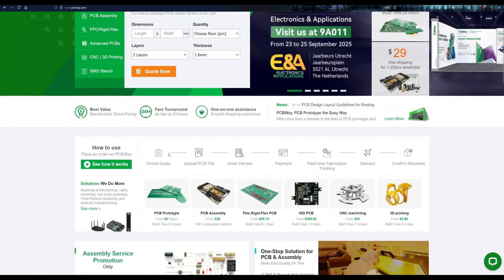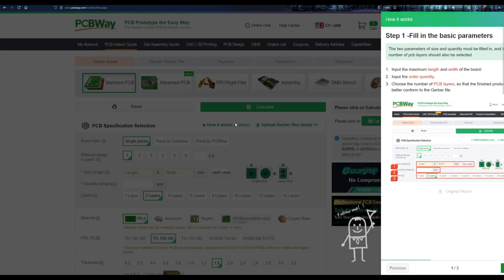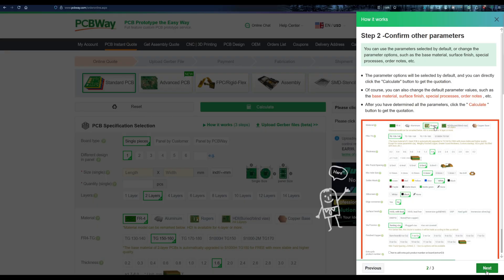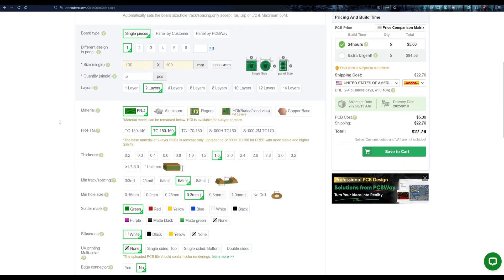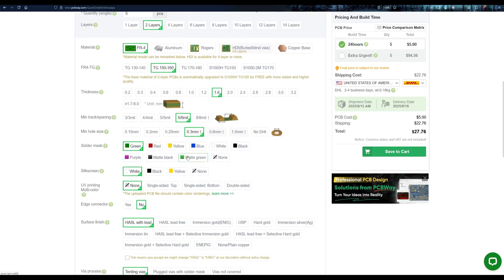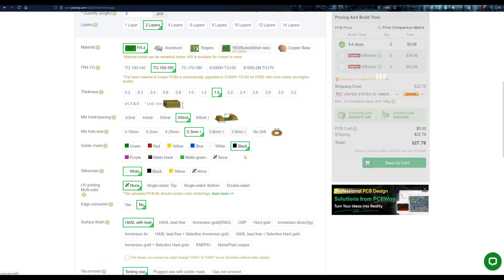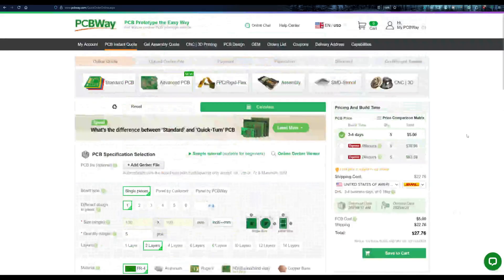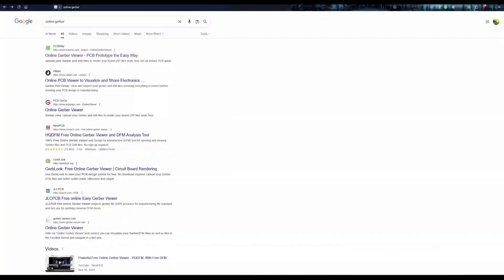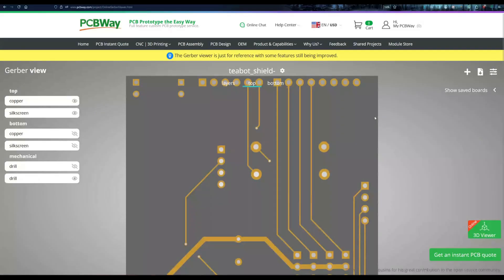Once you finish your PCB design, you generate a Gerber file, then we're going to use PCBWay since they are technically the sponsor of this project — thank you PCBWay. Upload the Gerber file; it's pretty straightforward. Most options you don't have to change. We're using two layers since four layers significantly increases the price. The color doesn't change the cost, so save to cart. An engineer will review your PCB design — since it was my first time there were some mistakes — the engineers quickly spotted them, we did a short review, I re-uploaded a new Gerber file and they approved it. It took only about two weeks to ship, and they also have a Gerber viewer so you can check your PCB design.